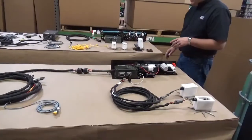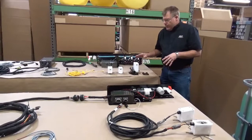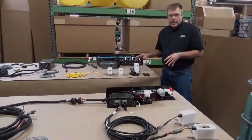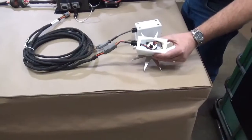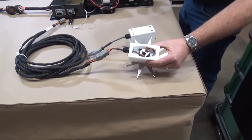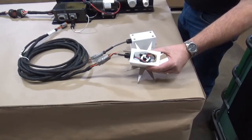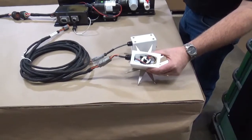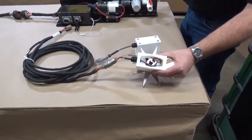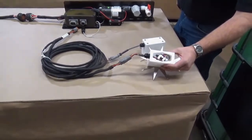Let's talk a little bit about the moisture sensors. With the 600 series system, we have three different styles of star wheels depending on the baler make and model. With the new 700 series, the encoder is inside the block, so we don't have to worry about damage from twine wrapping around the proximity sensors or the star wheel as we had with the 600 series. It is a more responsive encoder so that we get changes in baling rate a lot quicker.